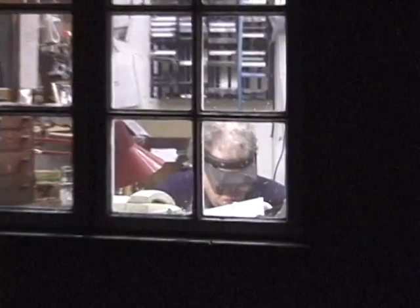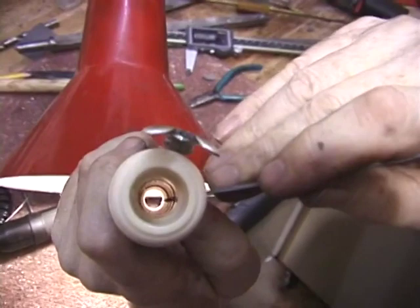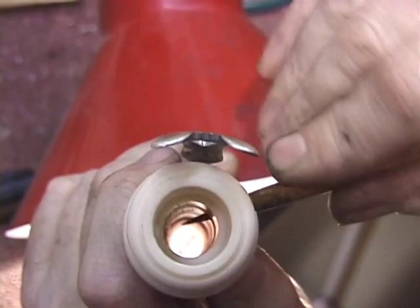Working late into the night here in my Scottish workshop. Doing some final tuning and finishing of the undercutting of the tone holes with a file, and then again with this little triangular crisp edge scraper. And then the most important tools in finishing the whole flute, including the voicing.